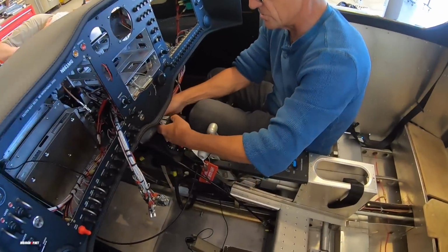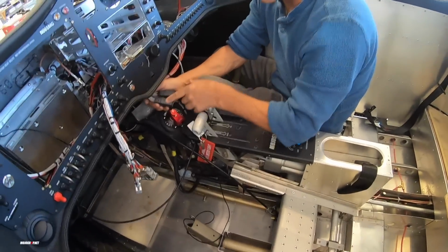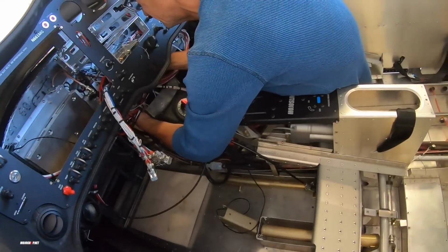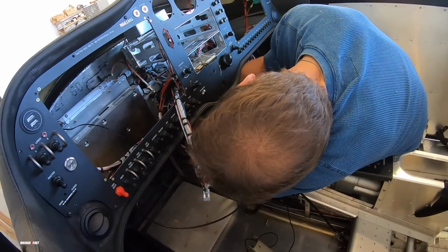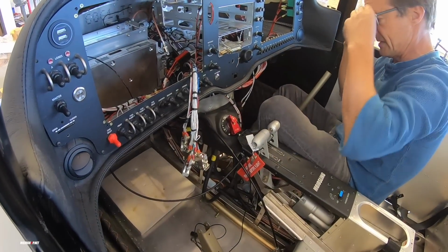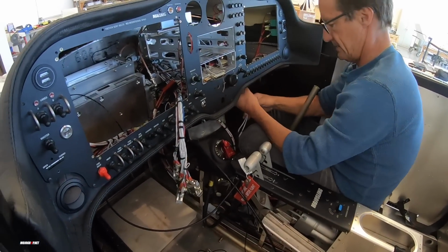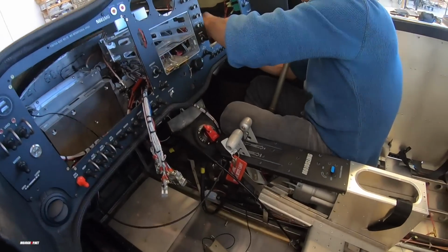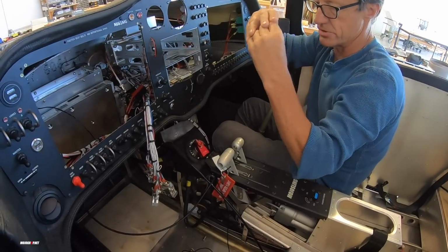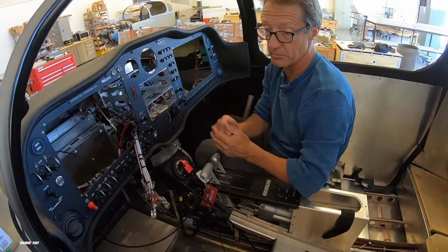Very important, these are the two plugs that come from the aircraft, and that marries these two plugs. That's for the engine, marry the engine plugs. So the engine harness will be going in, and these plugs will connect to them down there. For the viewers, when you think of the ECU and the computer system and the engine and stuff that you would read on your screen, that's what those plugs are for. Yes, that's your interface between airplane and engine. And that's the beauty of the Rotax 915 iS engines and the 912 iS engines.